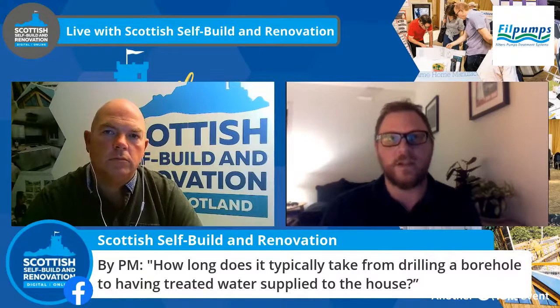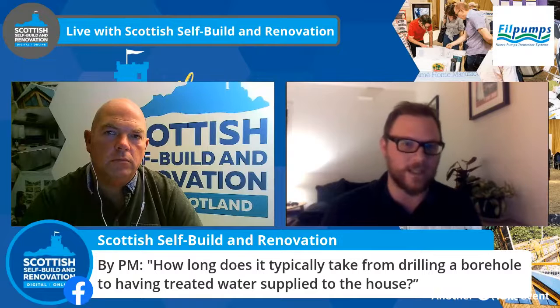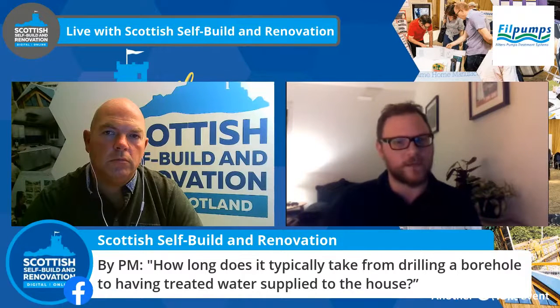So in total, it could be about the 10 weeks mark from start to finish, with a little variance for things like the lab lead time and whether the customer is able to get all the civil works done. And again, the brilliant thing about a borehole is you can space things out. So once the borehole's drilled, we cap it and seal it off.